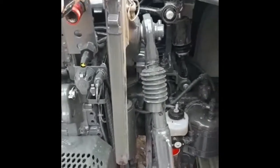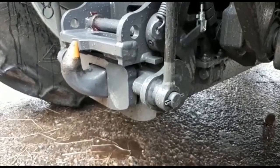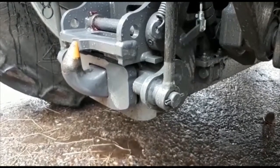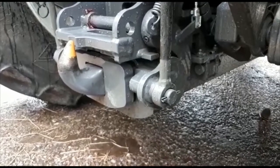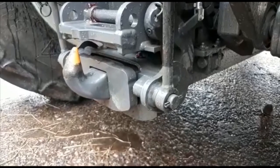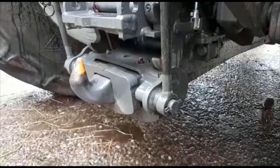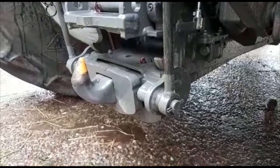These drop links should now be slack. Linkage up and pull the catches. Holding the catches out with your right hand, then lower the linkage down using the rocker switch. You'll see the catches return back into the rest position.